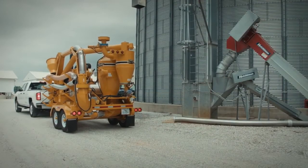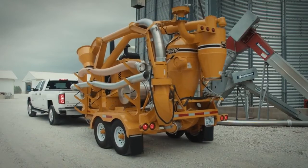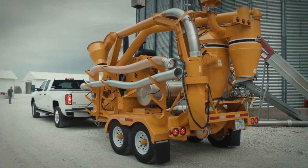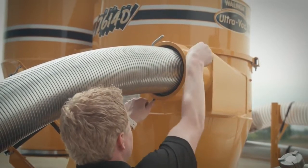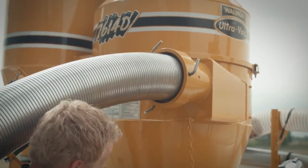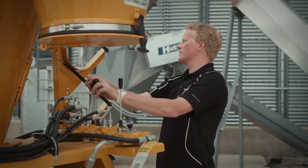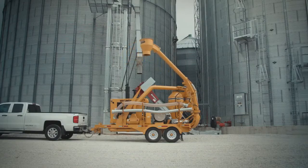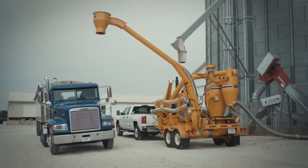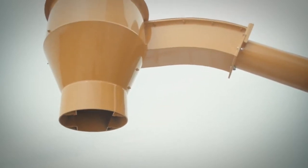The flexible stainless steel pipe sections store in their own rack and are secured safely with bungee cords. When the Ultravac arrives at its destination, it is quickly positioned beside the bin it will transfer grain from — in this instance, corn. The operator quickly connects together the required sections of flexible stainless steel hoses from the bin to the opening on the side of the receiver, where it is securely tightened down by Walinga tail bolts. The diesel engine is then started, and while warming up, the operator lifts and swings the truck loading boom off its storage cradle, rotating and elevating it into position so a semi truck trailer can easily position beneath it. If required, additional flexible pipes are available from Walinga for extra long runs, and the Walinga SRT blower can easily move the grain over the extended distance or height.